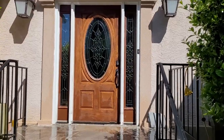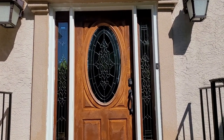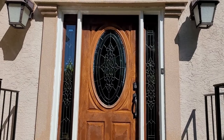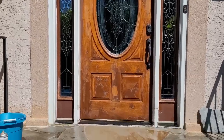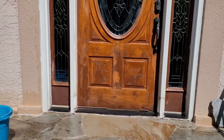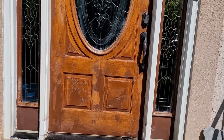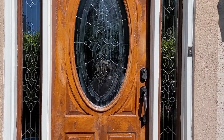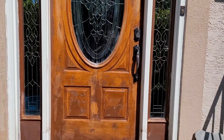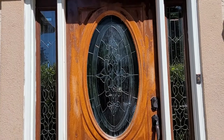The power washing was an interesting experience - it certainly took a lot more material off, though there are still patches. I may use a little Scotch Brite to knock some of those down. After more pressure washing and getting more finish off, they still look a bit scabby, so I went ahead and sprayed more stripper on there. It's certainly lighter, but I'm very pleased it hasn't lost all of its color - I was afraid it was just going to go bare white. We'll let this set for an hour or so, then hose it off, because that seems to work well. Then we'll try out our secret weapon.